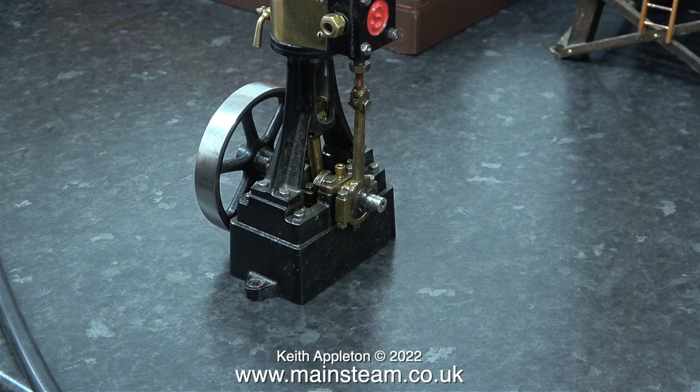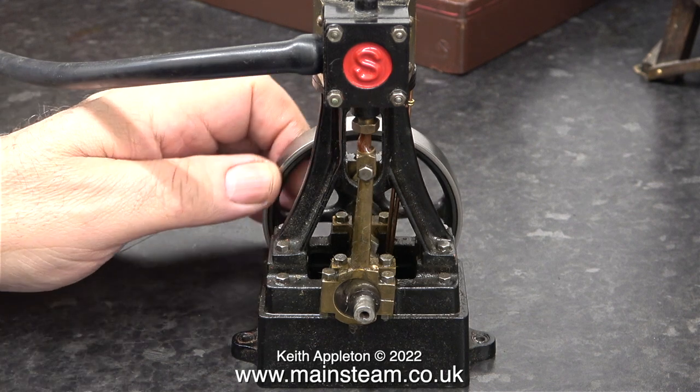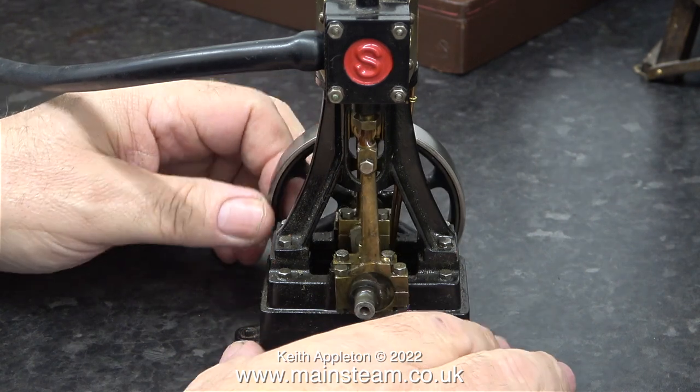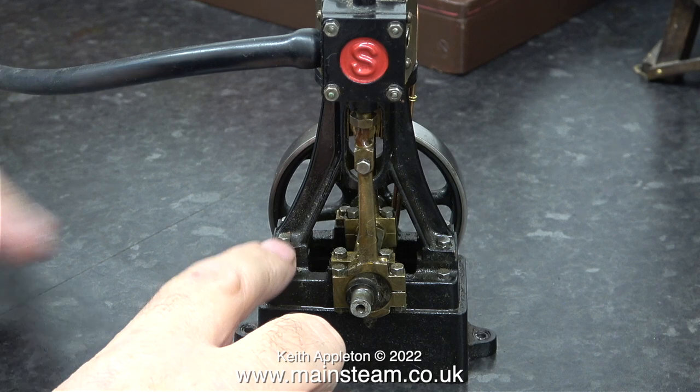One job I really have to get finished is the steam plant for my customer in the USA who sent me this lot. The first thing I'm going to do is see whether or not this engine runs. The other Stuart engine on the steam plant is a bright yellow S50, and I've worked on this in a previous episode, which I then sent back to the customer. With the airline connected and about 20 pounds per square inch showing on the compressor's regulator, I'm turning over the engine and it seems to be blowing quite a lot, but eventually it starts to run.